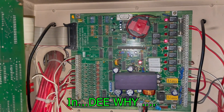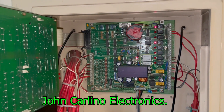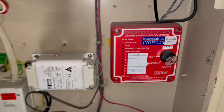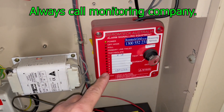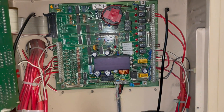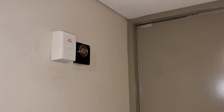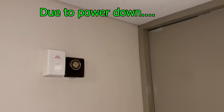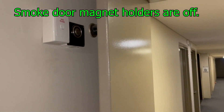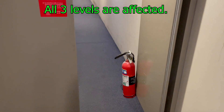We're going to go tomorrow to get a main termination board from my friend John Carlino from John Carlino Electronics. We're going to shut down the system — I already advised them of our intention to shut down. I'm removing the battery, so it's dead now. Because I shut down the whole power for the fire indicating panel, the door magnets are affected — those doors will remain closed. I temporarily placed a fire extinguisher there and left one door open.